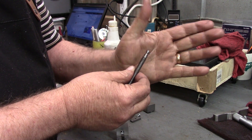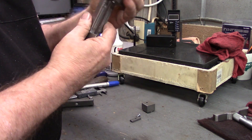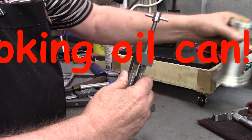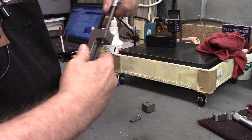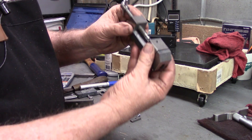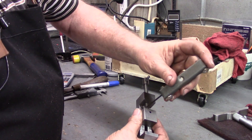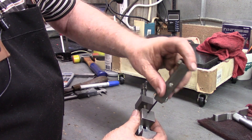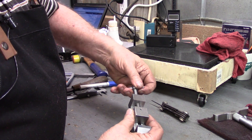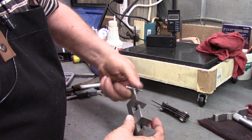A little squirt of oil in the grooving. Now we'll set our movable jaw in there — I have the set screw in there already, started. We don't tighten this down; we put it in where it fits that groove so it goes and comes in both directions.